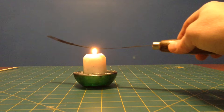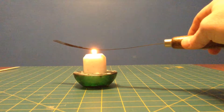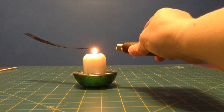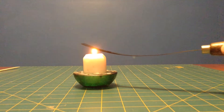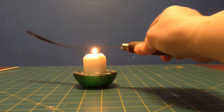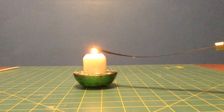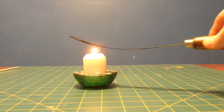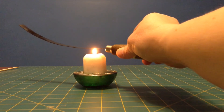So we can see this thing is curving now. And this is how a lot of the thermostats in our house work — the old kind. They have a bimetallic strip that will curve one way when it gets warm and another way when it cools down, and that will open or close an electric switch that will turn our device on or off. So we use this quite a bit in kind of old technology.